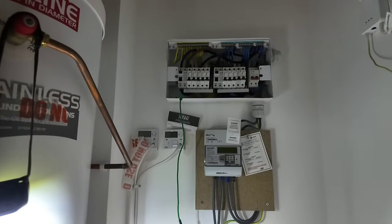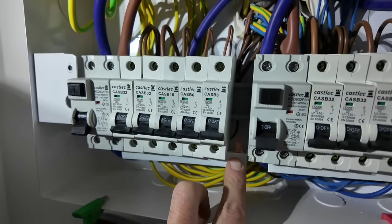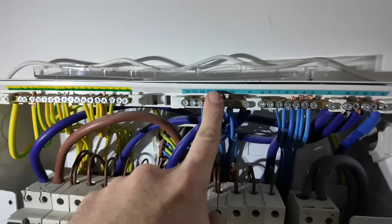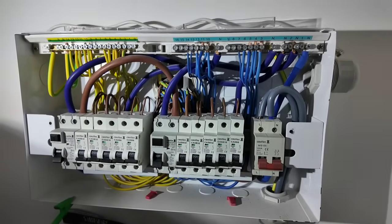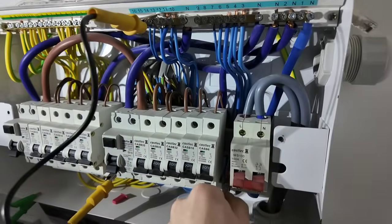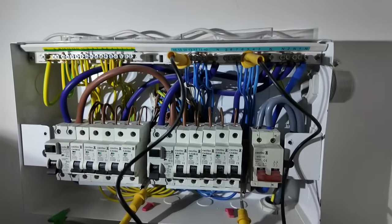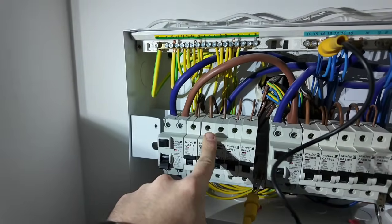Now I need to put some link connections in the board. I'm carrying out the test with line and neutral linked together down to the CPC. I need to put a link between the live busbar and the neutral busbar. I've proved everything is off and safe — always make sure, because if you bridge the live bar to the neutral while it's live it'll go bang quite spectacularly. I'll stick that link there and get our other one in. Now it's completely linked out — every live and every neutral will be linked together. I'll turn the circuit breakers on so they're all linked — live and neutral — to be tested down to the earth bar.